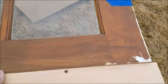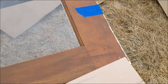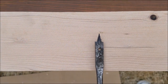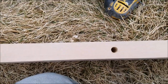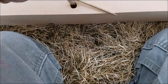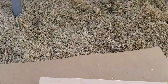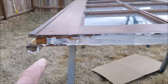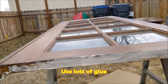The homeowner decided to put this on the top. Ran this through the table saw — five-quarters by three inches, or inch and a quarter. So we're going to glue that on there. First I got to countersink holes down for three-inch screws — four of them all the way across — using a three-eighths spade bit so my shaft will fit in there with the impact. I like using torx head screws because you can really bite down on them.